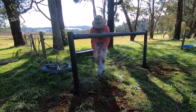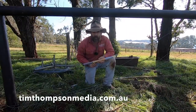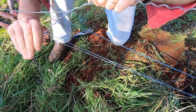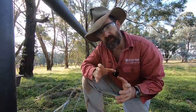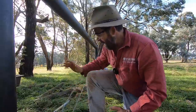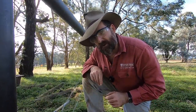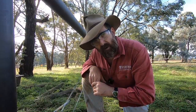Gone is the need to lubricate your staples. To make this box end assembly as strong as possible, I'm going to use a Spiral Fast. There's a link to Spiral Fast on my website, timthompsonmedia.com.au — hit them up for a sample pack. You'll be surprised how much stronger your fences will be with Spiral Fast. The plastic coating made putting on support wires so much easier — they just slipped around the post. Capping it off with a Spiral Fast should make this a really strong, long-lasting end assembly.